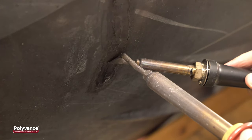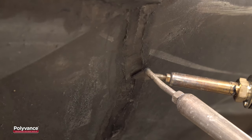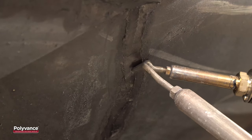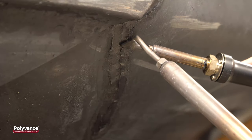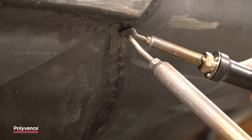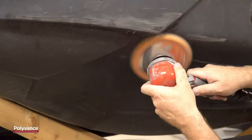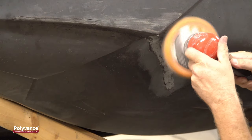As on the inside, when you have enough material to fill the v-groove, smooth the weld with the airless plastic welder. You can speed this process by using the hot nitrogen immediately in front of the airless welder tip to preheat the plastic. Move the tip slowly, allowing the heat to penetrate the plastic.